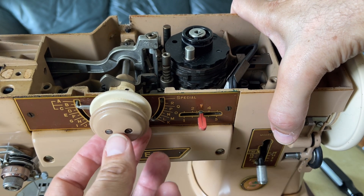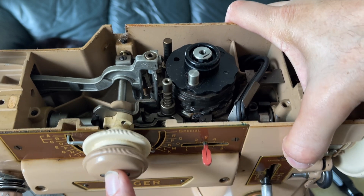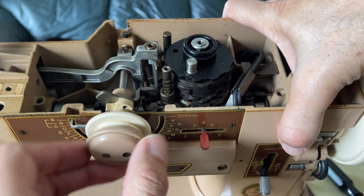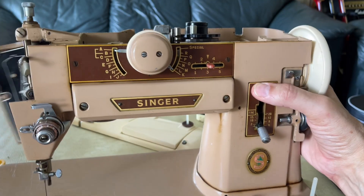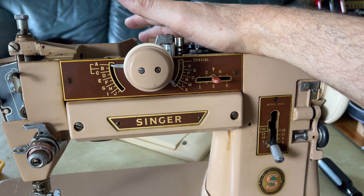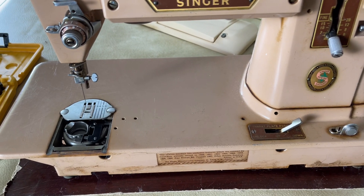Don't force it. This plastic has been fine since 1956–57 and it will last just fine. You can see all the steel behind the plastic — when that steel is free, moving, lubricated, and happy, the plastic is fine. The plastic was designed to be able to turn; it's attached to the steel and will be fine. You're not going to harm the plastic as long as you take care of the metal. I cannot emphasize enough how important it is to get things on the inside moving first.